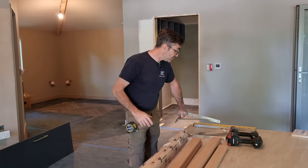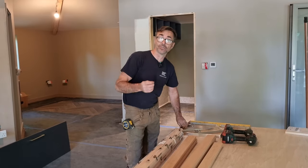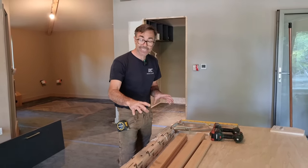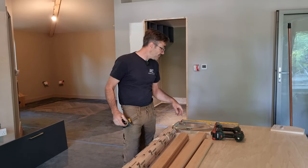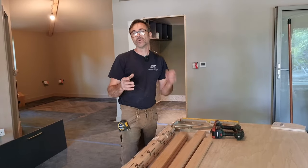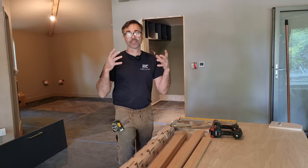It's a stud wall, and I know where the studs are, so I can just drill through. It's porcelain on the wall, so I've got to drill through the porcelain, put the brackets up, and then make the slatted bench and mount them from underneath. I'm going to put everything together with stainless steel screws, even though it's not technically soaking wet in there.